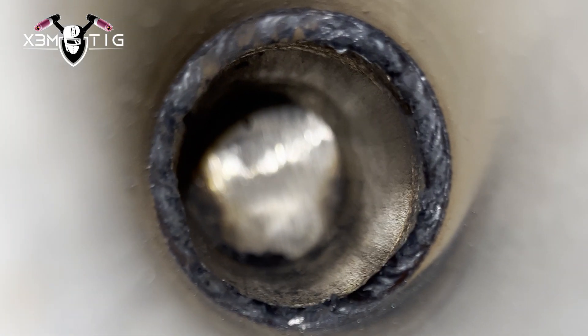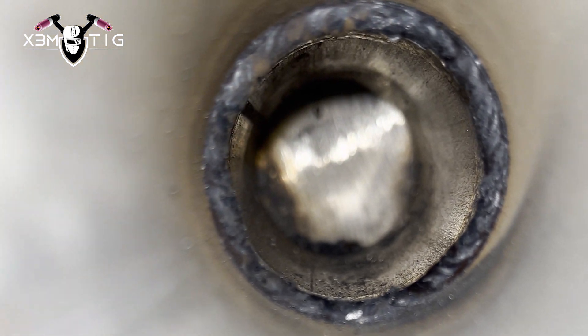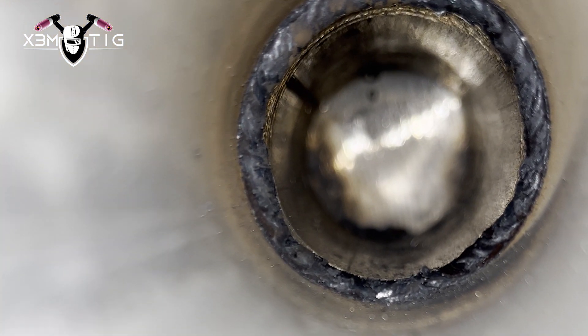This is how you control the amount you're actually depositing inside — you're not going to have that excessive root. Once you go up on the top, pause a little bit before your tie-in. Slow down, pause, and add rod as needed. At this point you can even step back slightly and then continue. This is the final root — this is how it looks. Minimum stops give you a nice, good uniform root, especially when you're allowed to use grinders.